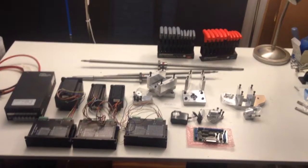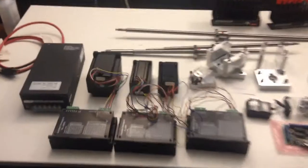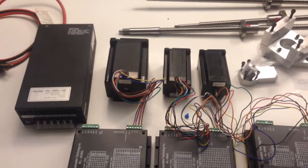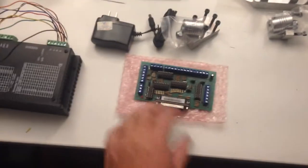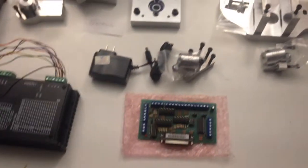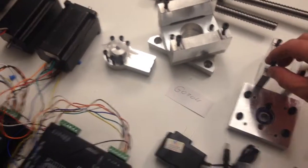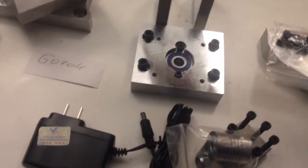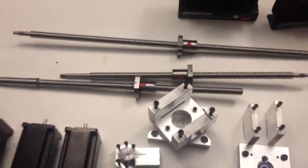Here's the kit I'm going to attempt to install on my mill from Automation Technologies — it has three-axis motion control. You can see there's the X, Y, and Z-axis, with the big motor being for the Z, and there's the power supply and the three controllers for each of the motors. Here's the breakout board which has a parallel port that you plug into your PC to control the system. And then here are the mounting brackets — the XY bracket was actually incorrect; the threads on the bolts included for the standoffs do not thread into the holes. Then there's the one that goes on top of the mill for the Z.